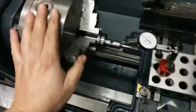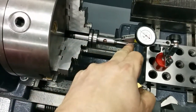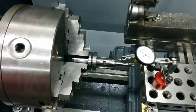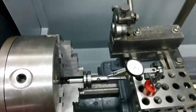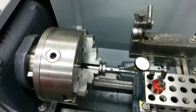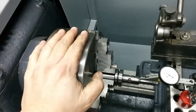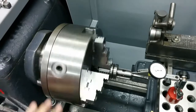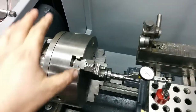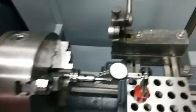The only ground thing I had was a Tormach TTS — basically an edge finder — which is ground and very precise, easily within a couple tenths as far as runout goes. So it's lightly chucked in here. I cleaned the chuck completely, got all the crap out, re-greased it, put it all back together, checked the spindle nose — good — checked the back plate — good — put the chuck back on and just barely snugged it up.